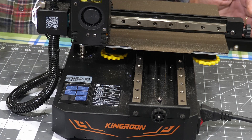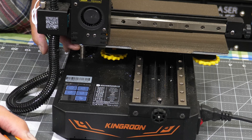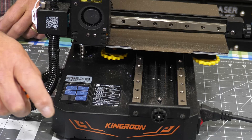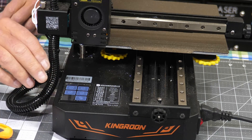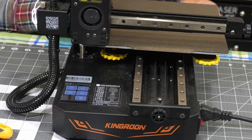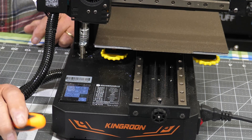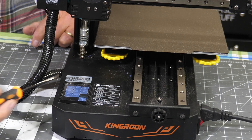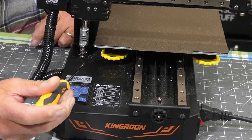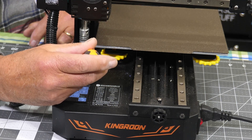There's a huge thickness difference here. The screw right down here where the limit is sitting — I need to turn that down a little bit to let this travel farther down. I'm going to turn my knobs up here too, but it's running out of adjustment on this back corner. Also, if you're putting one of these printers together for the first time and you're having trouble with leveling — running out of space or can't get it up far enough — that's what this screw right here is for.